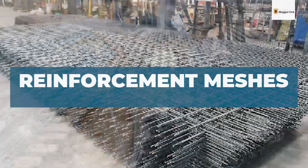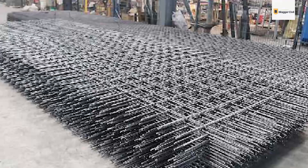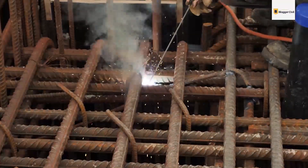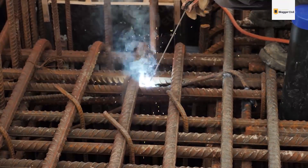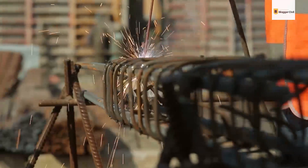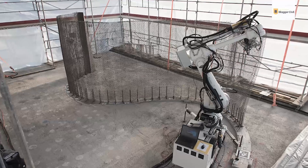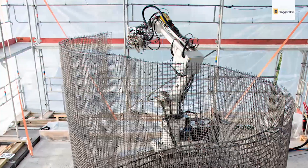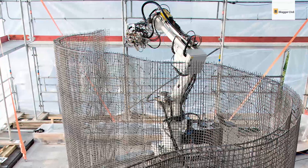Reinforcement meshes are also a popular option for passive reinforcement in construction. Just like rebars, the meshes are welded together and laid between layers of printed concrete slabs. This process does not require any formwork either. Sometimes meshes are also used both as reinforcement for the dried concrete and as a modified sort of formwork to support the printed concrete in its fresh state. To achieve this, multiple spools of mesh are simultaneously unwound right ahead of the printer nozzle.